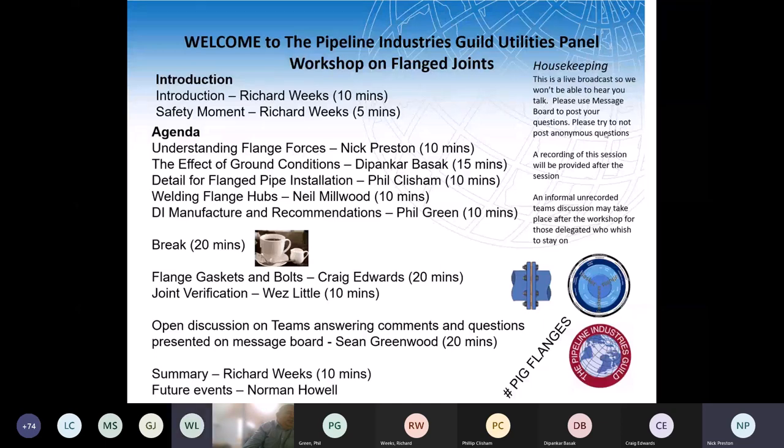Yeah. Go on, Phil. What I would say is we go to a lot of sites and there's lots of people on this call that have had me out in recent months, and we are finding it is increasingly difficult to have conventionally available torque wrenches that will fit into the gaps that valves often provide. You can't reorientate the bolt, so you can't have it facing the other way, because if the torque wrench won't go in, the bolt won't go in. So on lots of valve stacks, there are a number of bolt positions that are inherently difficult to get any kind of torque wrench on.